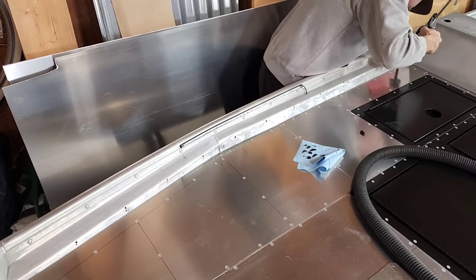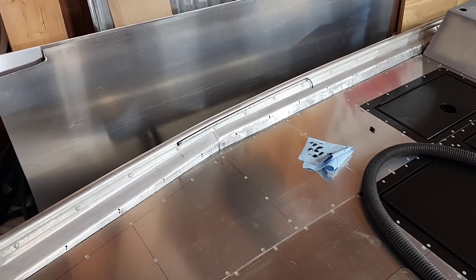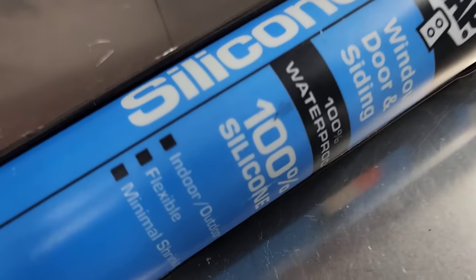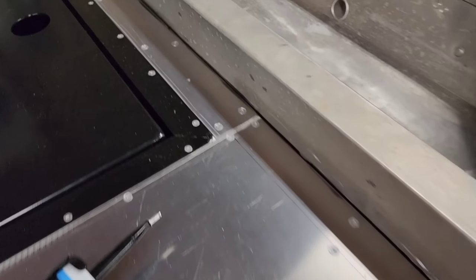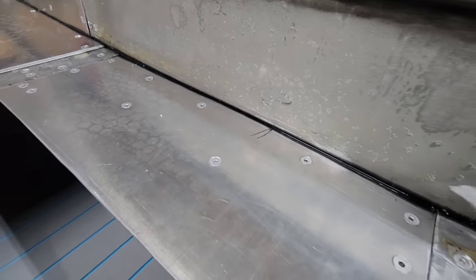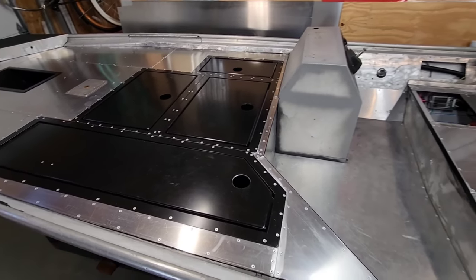We were almost ready to do the EVA foam decking, but not so fast. The last thing I would need to do is seal all the edges of the decking with silicone. We worked really hard up until this point on the boat, and a lot of money was spent on the lids with the anti-flood tracks. I hate to see our work or that money go to waste by skipping the step of sealing all the deck edges. I know a boat is not a submarine, but we also don't want water to get to storage areas that we designed to stay dry.